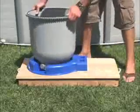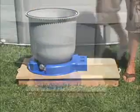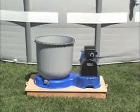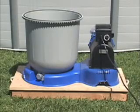Place the tank on the selected location or base and connect the pre-filtering assembly to the tank support base. The water inlet valve must point toward the pool. The product can be mounted on a cement platform or wooden base as required by some communities. See the manual for more details.